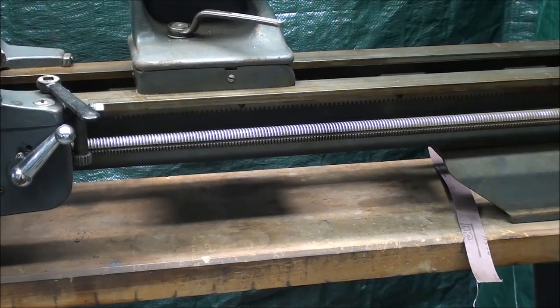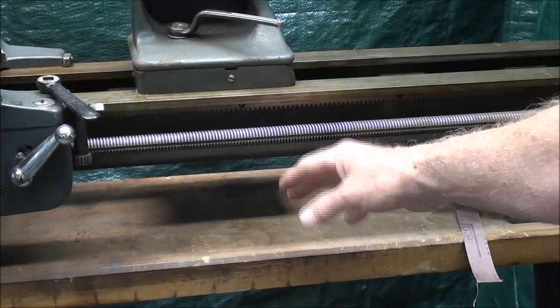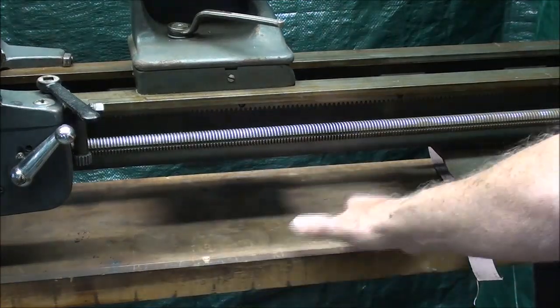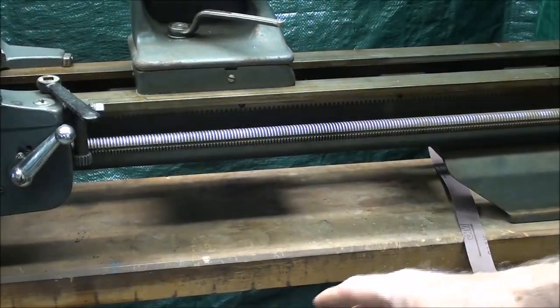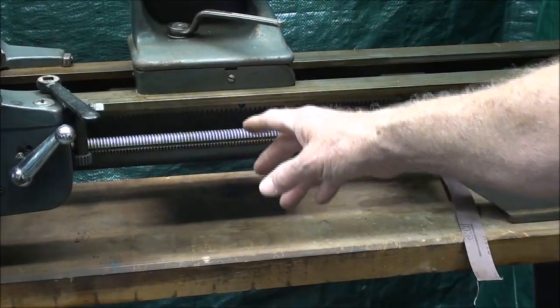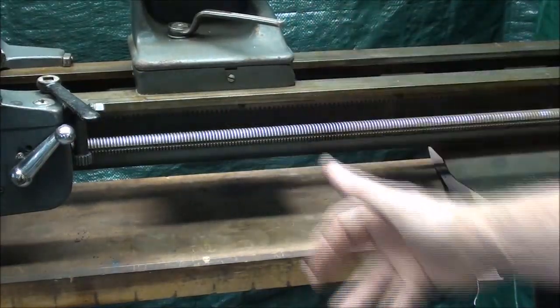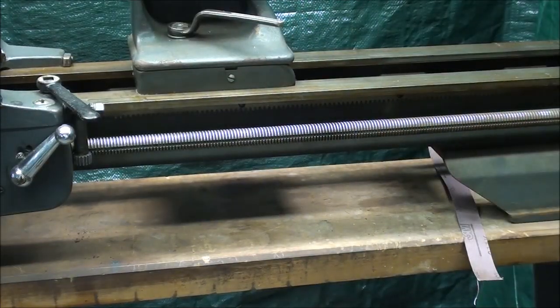One other safety thing that I want to mention, and it's certainly a rare thing, but sometimes the boys, when doing a long lathe operation in high school, would set their foot up here. Especially the taller kids, they'd set their shoe right up here in order to rest just a little bit. And that was during that era when they wore those frayed blue jean cuffs. And I did have, in several cases, the frayed blue jeans get caught in the lead screw and pull the leg in, but fortunately the kid had the good knowledge and thoughts to turn the machine off. But you know, pull your leg in, and denim is quite a tough material, it doesn't tend to tear. So do not put your foot up near the lead screw.